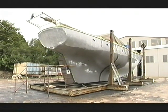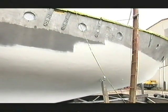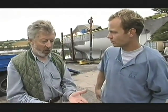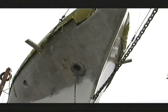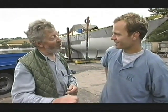Then the war came along, and then afterwards it was picked up by the Canadian designers and by New Zealanders who specialised in it. Right. And this is a Canadian design, this one. And it was 12 months to the day from me first setting it up in a gantry, right, to actually fastening it. So that's a steel framework welded together. It's a steel framework with horizontal steel rods every 3 inches. Right. And 1/8 steel rods vertically every inch and a half. Right. And then there are 7 layers of mesh, 3 inside and 4 outside, all tied together with little hairpins. Right. And twisted laboriously with a pair of pliers.